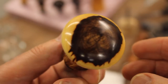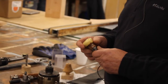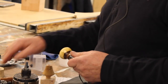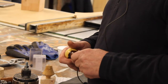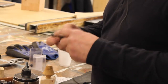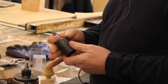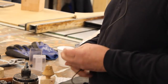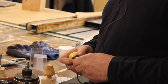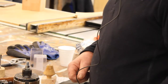The other day I was trying to figure out how to stop that, and I put a little bit of CA glue in there and left it for about ten minutes and then put it on my mandrel. It was sticking pretty good. But when I took it off, my threads and the slot for clearing the wood were full and packed hard, and it took me about forty-five minutes with really good sharp tools to get that out of there.